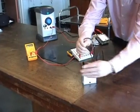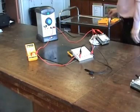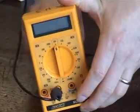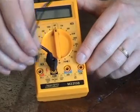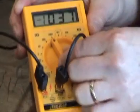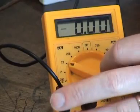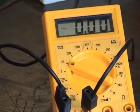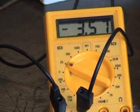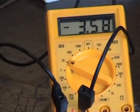To finish up, it doesn't matter whether you use an analog voltmeter — the voltage was about 4.6 volts. If I go back to a digital voltmeter: one lead always into common, one into volts. Turn the dial to DC voltage and bring it to the range you'd expect — I'm expecting about 4 volts, so I set it between 2 and 20, which means setting it to 20. I'm getting a reading of 3.57 volts — the minus sign just suggests the leads could be switched around. So 3.57 volts is my voltage.